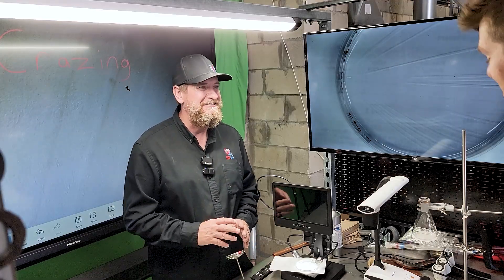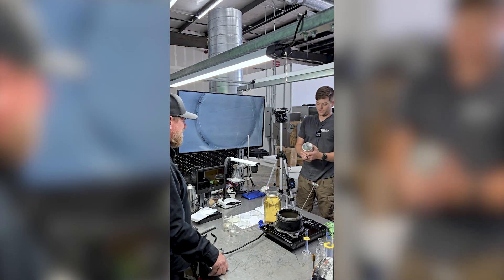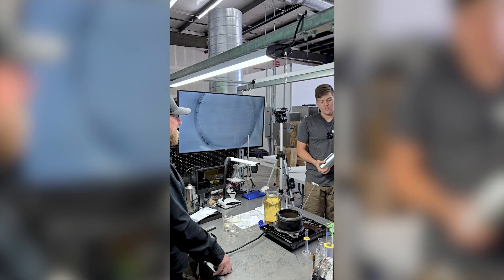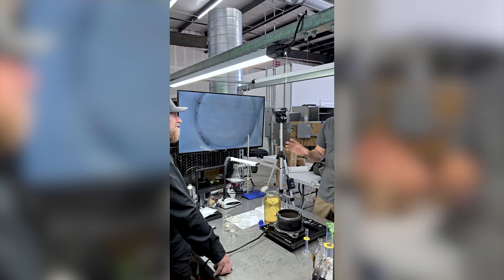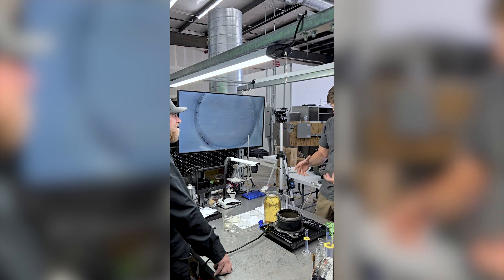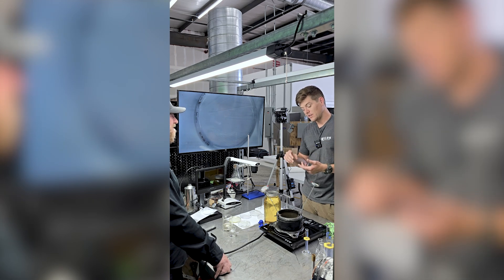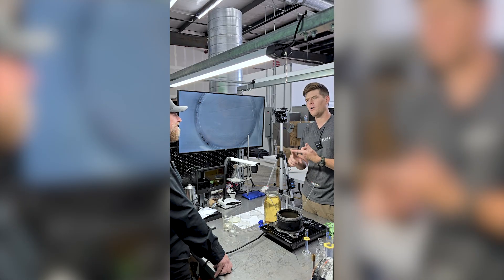This is something completely new that I learned, and it's super exciting. These are two different lubricating oils — PVE and POE — and it turns out it's the ether or ester in those names causing the chemical reaction that we see here: actual embrittlement of plastic. And it's not just all plastics — it's specifically PVC: your schedule 40, schedule 80, anything that's polyvinyl chloride. And it's also ABS plastic.